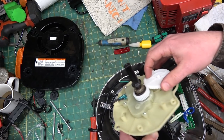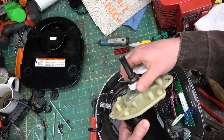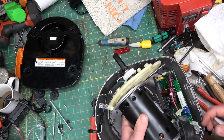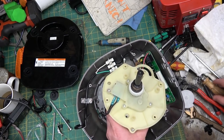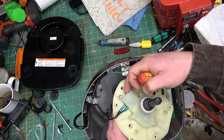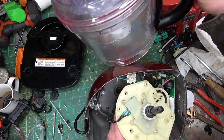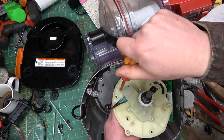Here is the sizing selector — it's run by that lever and it's on a very coarse thread form. It just goes to and fro. All kinds of smooth in that bearing, no rust — she has not had a hard life, up until this point when I took it apart. Also, that switch I said was a thermostatic switch in case it overheated — it's not at all. It's a micro switch that takes full voltage from the wall and unless you are indexed and engaged with the receptacle it won't energize. That's a safety interlock switch.